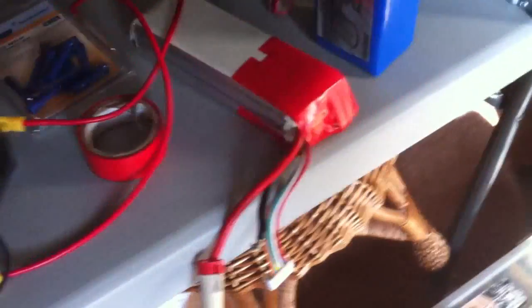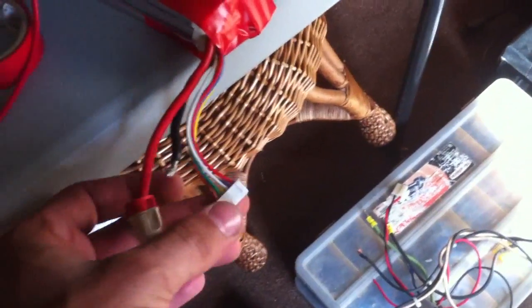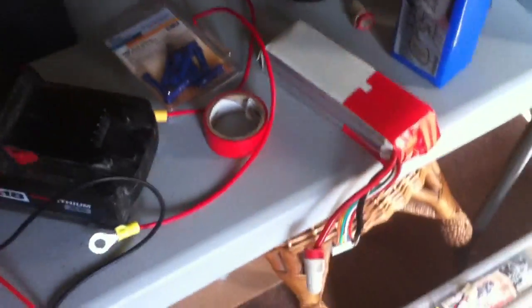I was using my M18 pack that I use at work — I would just stick these terminals in there and tape them down. That would give me five cells in series and I just need five more. I had this scary LiPo pack that I got from a bunch of bad packs from an RC store I did some electrical work at. They just didn't want them — they all got puffed cells. This one was a six-cell pack and only one cell was bad, so I popped that cell off and made it a five-cell pack. It's actually been working pretty good, but it's only about 2.6 amp hours.